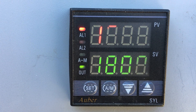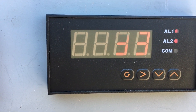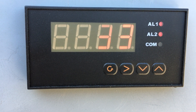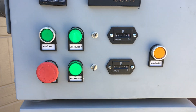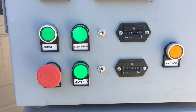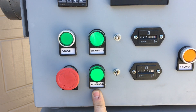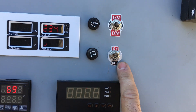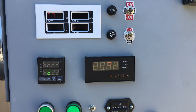And then here, same thing — it's strobing, but hopefully you can see it. Right now it says the furnace temperature is 1688, it's set on 1800. That shows it's 33 degrees Fahrenheit out because that's my pyrometer hanging on the tree over there, but when I insert that in the furnace, I get a reading on the metal temperature. The button on the right allows me to turn off all the furnace coils so I don't electrocute myself when I reach in there. The rest are just power meters and status lamps — this tells you if power is actively being applied to the coils. And this shuts down everything if there's a panic. This little circuit up here is just the DC voltage circuit for controlling the actuator up and down on the furnace.